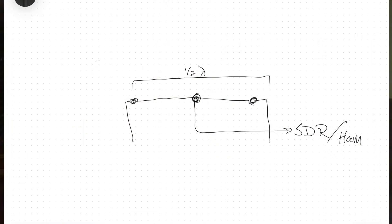Radio Jove uses something called dual dipole antennas. A very common antenna used in ham radio is called a dipole, and the reason it's called a dipole is that it has two sections to it. You set up two large poles and you run a piece of rope to an insulator, and then you have an antenna wire on either side of what's called a balun. This would be the positive side of the antenna, and that would be the negative side. Then you have a feed cable that goes from this balun in the center over to your SDR radio or your ham radio.